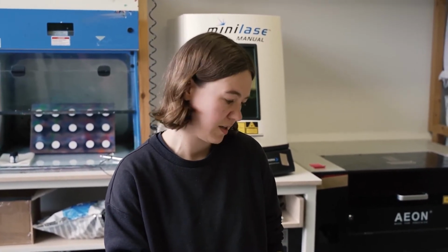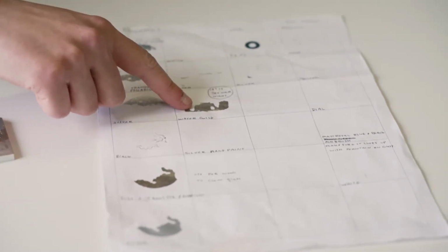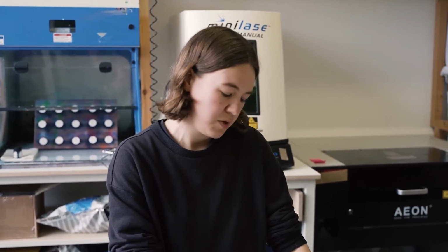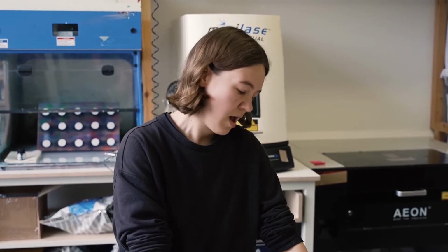Hi, I'm Ellen. I'm Senior Print Technician at the workshop in Vanguard Court for Mr. Jones Watches. We are currently printing the Ascendant watch, and it goes through a couple of processes, including size gilding and water gilding. It's got about nine layers with printing and gilding, with green inks, black inks, white inks, and silver. We use palladium in this watch, transfer, and we also use loose leaf for the water gilding.